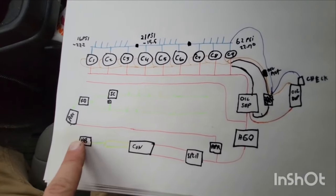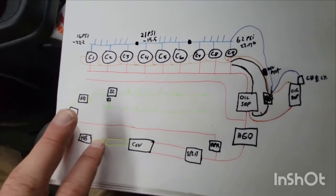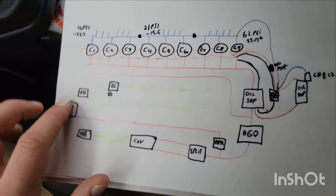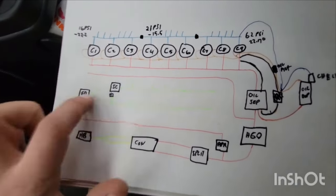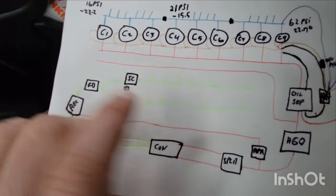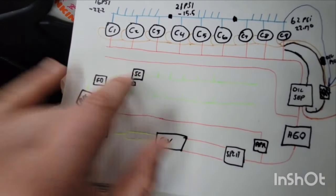Coming over here, we have our holdback valve. Again, you can check across that. Is your holdback valve artificially closed? Did somebody mess with it, okay? Coming down further, your receiver, nothing you can really do there. Filter dryer right there, okay? So is this filter dryer on your rack, does it have an extreme pressure differential across it?